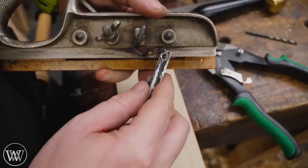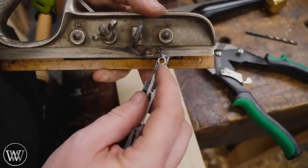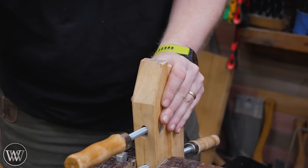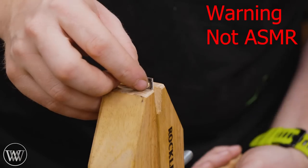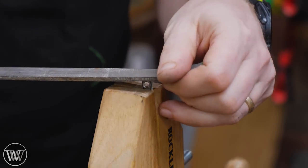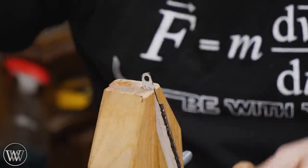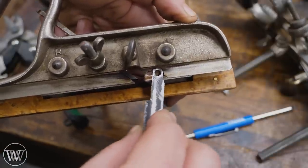So now we can start the shaping to make it fit in there. You can see that this square shape is not going to fit into that round hole, so we want to remove a lot of material around this hole, getting very, very close to it. We want to be able to rotate it so it can go into the closed position as well as down into the used position. A hand screw clamp in the vise makes it really nice because it raises it up so you can work on a very small piece with just that hole sticking up. Now I can come at it with a relatively fine file and start taking it back, rotating it and making sure I've got the right axis to round all the way around. After a minute or so of careful shaping, I now have this round space that fits that radius inside there.